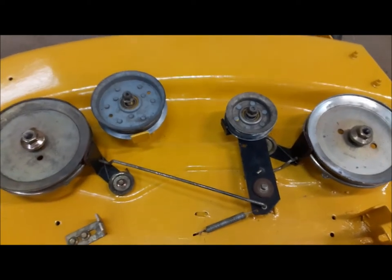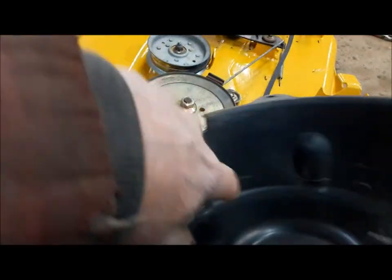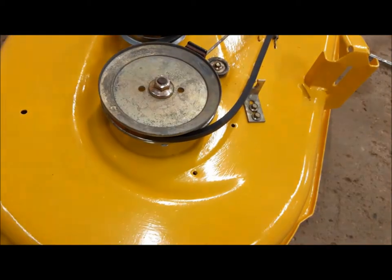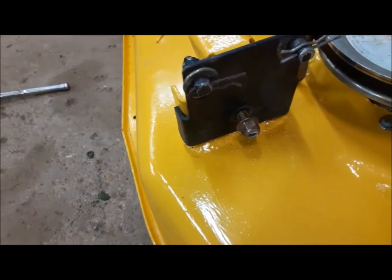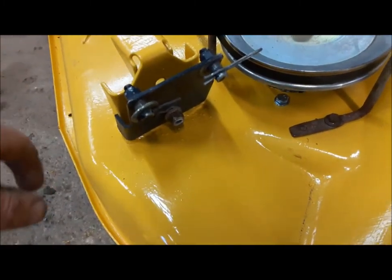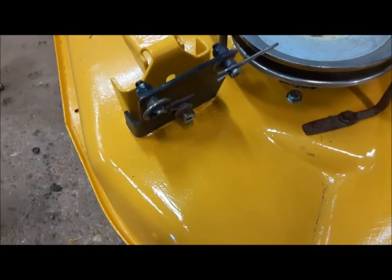Now we can fish the belt through. We're going to install the belt cover on this end, which also doubles as a belt keeper. You can see it's got these ribs in here, and on this side they've actually embedded a piece of steel in there, which this belt has already worn well into. There are also two other little belt holder brackets that go on the other side. Now I'll install the hanger brackets for the deck, placing them approximately where they were when I took it apart. Once the deck is hanging from the tractor, we'll get out the leveling tool and level it properly so it cuts nice.